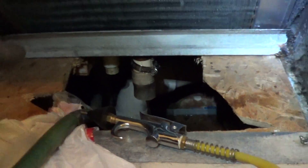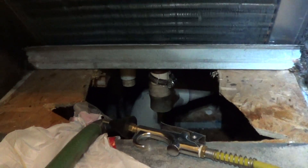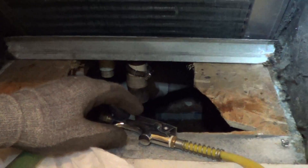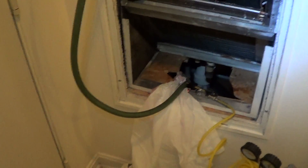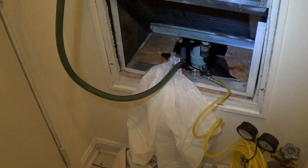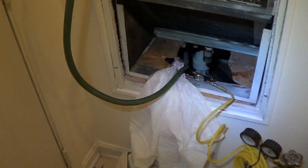So a combination of the water — usually the water just flushes it out fine, but when there's a hard clog, through the water and the nitrogen. Then I'm going to check the unit upstairs just to make sure it didn't blow out. It probably blew out a little bit of water, but it's mostly nitrogen and that gives it a good hammer. I would have videoed it, but it sounds like a bang when the nitrogen forces that water hydraulically with the high pressure and forces it down the line.